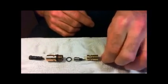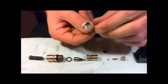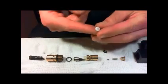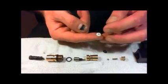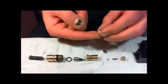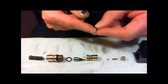The seat — this is a seat I've made but it's a copy of the original BSA one. It's basically a little hat shape. It's 8mm or just under 8mm in diameter on the bigger section and around 5mm on the inner section, just over a millimetre on each step, and about a 2.5mm hole through the middle of it. And then onto that there's a little o-ring.